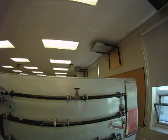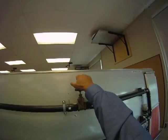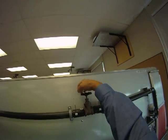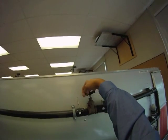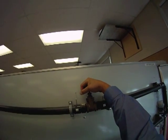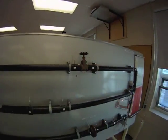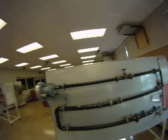So if you want to show you know what you're doing when you walk in, walk right up to this and turn it counterclockwise viewed from the top, all the way out until it's fully open. You don't need to really crank it — just until you reach some resistance and then you'll know it's fully open. Once it's fully open it would be safe to start the motor.